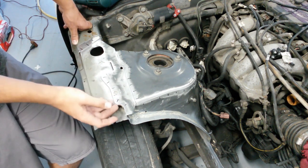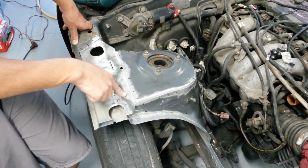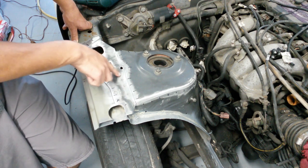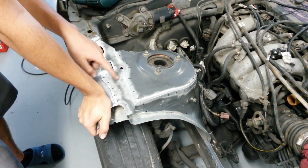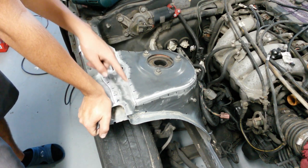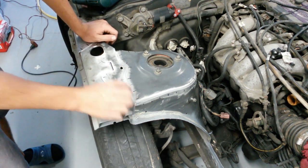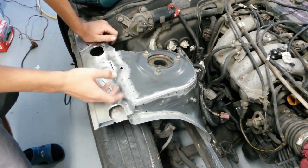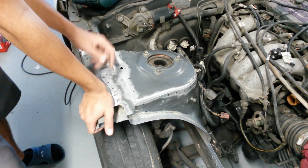Now, this car has over 240,000 miles on it, so you can imagine 240,000 miles worth of vibration on these welds makes them fairly weak. And as you can see, these factory welds are quite spaced from each other, and so when you do your stitch welding, it makes the whole structure much stronger because you're tying it in more points, and on top of that, these are fatigued weld spots that have been over 240,000 miles of driving on them.